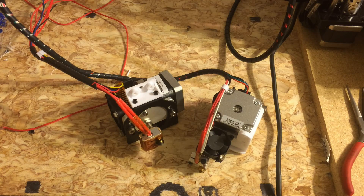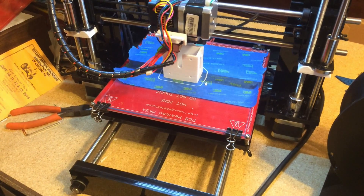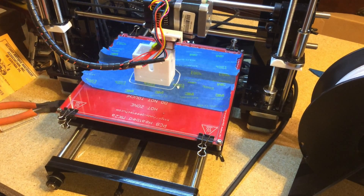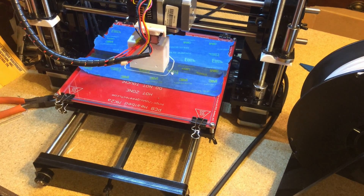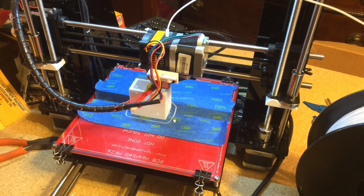So let's start with why I decided to build my own printhead. The head that came with my printer is extremely cheap as well as poorly designed. One of the major problems I ran into is that although the literature that came with the printer claimed that it had a 0.4mm nozzle, this is definitely not the case. After many tests, it appears that the nozzle had a diameter of about 0.25mm, which although is great for fine detail, caused my prints to go horribly slow.